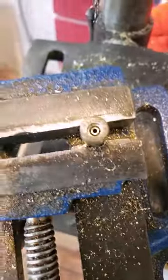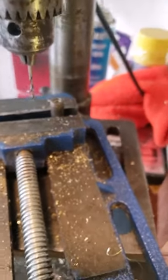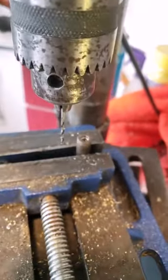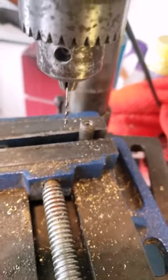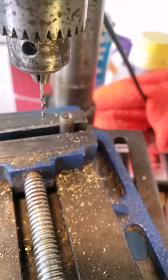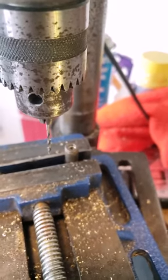I will kiss this with the end mill. The other reason is because the Berdan primer cups are a little bit shallower, so I'm going to take off a tiny bit of the inside of the primer cup and make it a little deeper for the new cup.